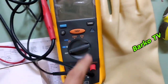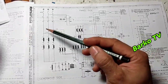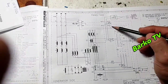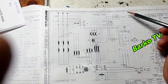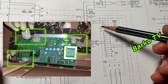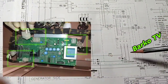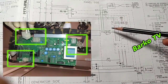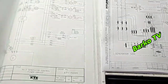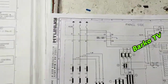Looking at the IR tester — we need to use PPE. Going back to the manual: at the top is x1, which is for the AVR. We need to disconnect that. At the AVR there are three terminal connectors: x1, x2, x3. Before we start the IR test on the main stator, we need to review the schematic and isolate all connections going to the main winding, including the ACB.